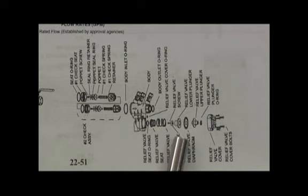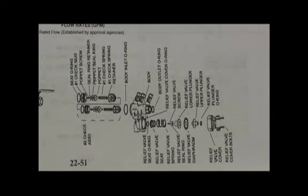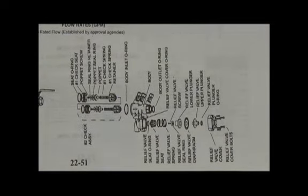So here's the cover, our rolling diaphragm, stem, spring, and relief valve seat. Check seats first, and check assemblies, first check and second check, slide in through here. This whole mechanism slides back into the chassis for the average repair.